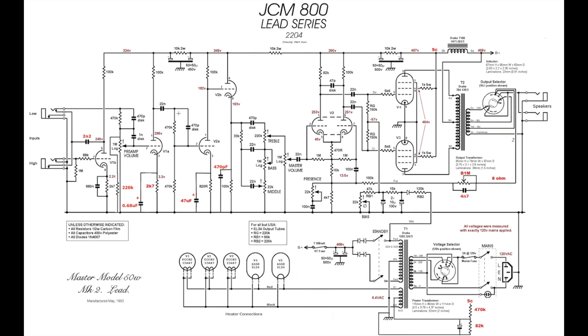Out of there, this is all unchanged, right? Here I've got a 47 microfarad capacitor on this cathode resistor. This is often called the fat cap. It's a term that was used to describe the capacitor that was added to Eddie's number one plexi amp. So this definitely fattens up the tone and helps to drive that gain stage.